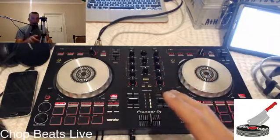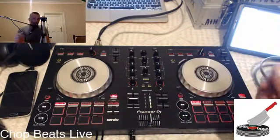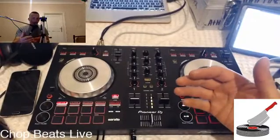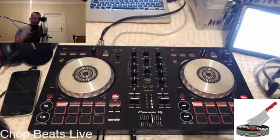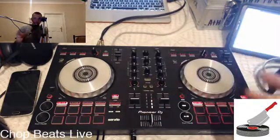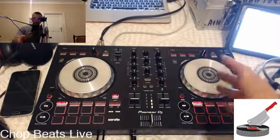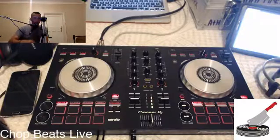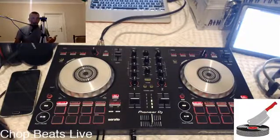If you wanted a cheap, quick and easy way of using a different output, you can use an audio splitter in reverse. You can search this up on YouTube and you'll find it. You get a little 3-way passive splitter, which has got a phono input and 3 pairs of phono outputs. Then you can output to 3 different receiving ends, and you can adjust the gain and output to whatever you want. So you could output with 1 pair but control 3 different levels, like a booth output and all that. I haven't used it personally, but there is a tutorial on YouTube if you wanted to do that.